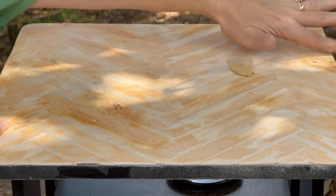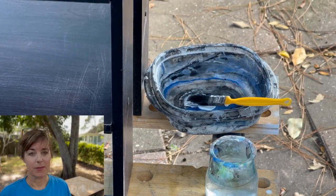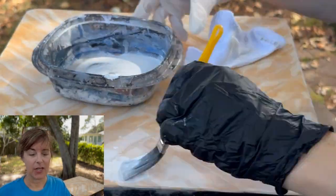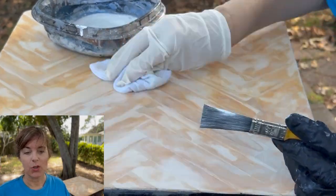The original plan was to just sand it up, put some Danish oil on, and call the top a day — just let it be its natural self. However, while the wood filler did a great job filling, unfortunately it also left a good deal of staining behind, and I don't really like that orange color. So I'm going to go ahead and give it a whitewash. This whitewash treatment couldn't be simpler — all I'm doing is watering down some chalk paint, putting it on, and then kind of wiping it off rather quickly so it's not leaving too much pigment behind.